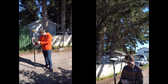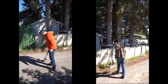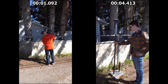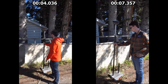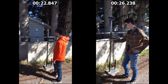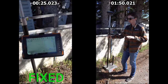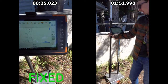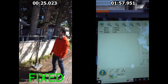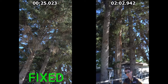Our last test was arguably the most challenging. We had big pine trees blocking most of the sky, plus power lines running both parallel and perpendicular to each other, making it very hard for receivers to get a clean lock on satellites. The Hemisphere still managed to get a fixed solution in just over 25 seconds with good residuals. The Leica, after another two minutes or so, still didn't see the residuals coming down and was unable to get a fixed solution — the receiver just wasn't able to get a reliable position.